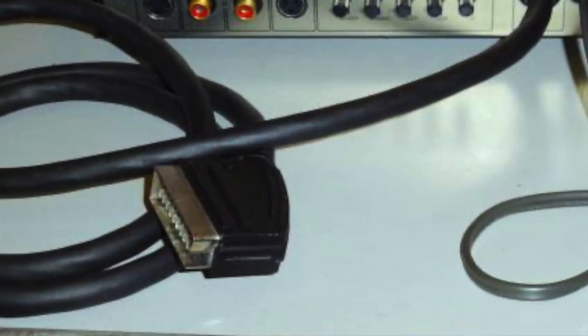Now typically this comes with the JP21 connector on the end — that's the output. The JP21 is the Japanese SCART; it's physically the same, just with the pins rearranged. Now the reason this unit is a one of a kind is because it has been modified on the end. The JP21 connector has been taken off and some Japanese guy has added this box, which has got RGB and sync as BNCs, already broken out for you.